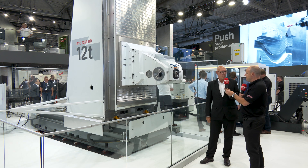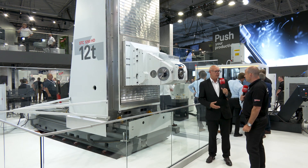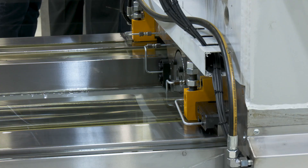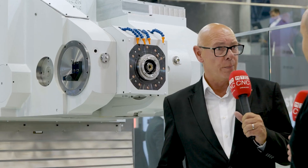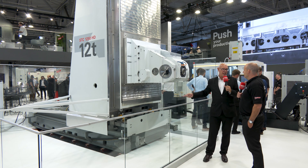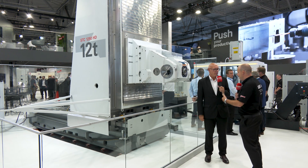There's no metal-to-metal contact, but how about speed? People generally believe that a linear rail machine is quicker because it's much easier for the ball screw or whatever's driving it to move. But with this, it doesn't get much more simple than pushing it with your fingers when it weighs 12 tons. The structure is so stable that we can cut faster as well, which is very important.